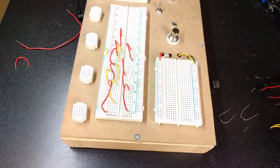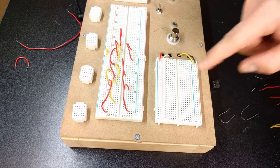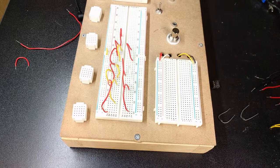So we've already talked about this circuit and now I want to test it on my workbench here. I really just want to show you how easy it is to make a voltage doubler, and you really don't need that many components. There's really just one key component for this. It's again just a quick way to boost your volts from 9 volts to approximately 18 volts so you can supply those pedals that need a little bit more juice.